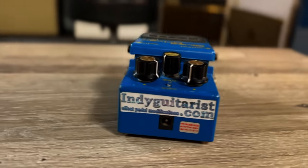Some people in the past have talked about the blues driver being a little bit fizzy. I typically would agree, and whenever I was doing a lot of mods back in the day I would try to take that fizziness out. In fact, I did a mod for Brent Mason before we came out with the Hot Wired, where that was kind of the gist of the mods — take as much fizz out, add a little bit of beef to it, a little bit of mids, add a little bit of clipping dynamics. So that's kind of where my brain started, but I didn't really do an exact mod like that because it's using some different circuitry as well. Not an exact clone, but that's the skeleton we started from.